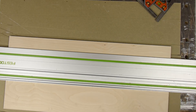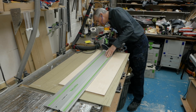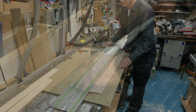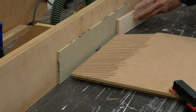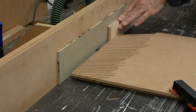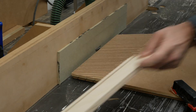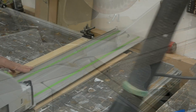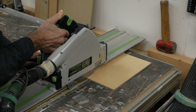Using my combi squares trick to line up my guide rail, I'm ripping 65mm or 2.5 inch strips from the sheet of 12mm ply. Then moving over to the router with a sacrificial fence, I'm running a 6mm deep groove in the strips with a quarter inch grooving bit. Then cutting them to length on the mitre saw and trimming the 6mm birch ply base to size.